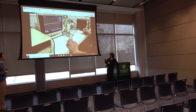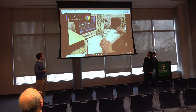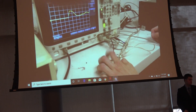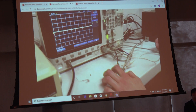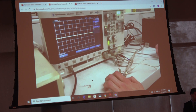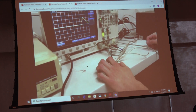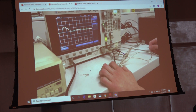This is the hardware video. By pressing the piezoelectric device, we're able to generate voltage spikes on the order of 20 to 40 volts, lasting about 100 milliseconds. We plan on having multiple of these devices in the shoe, boosting charge into a battery, and stepping it down to the wireless transmitter. Our go/no-go was just the generation subsystem, and as you can see, we generate and maintain voltage across the piezoelectric transducer. We rectify the full range and get a DC average which we can harvest.